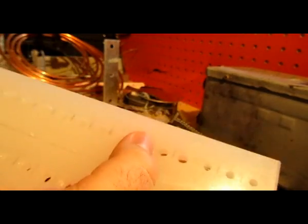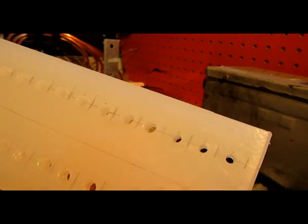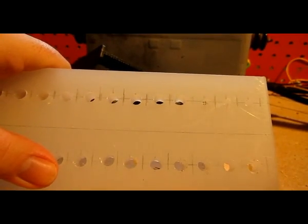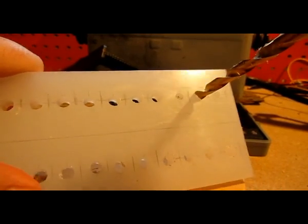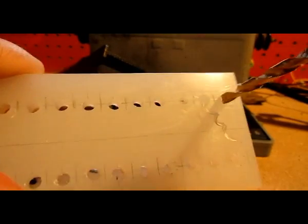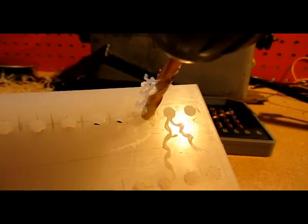We've seen these last three 5/32 inch holes — there's just over a quarter inch. I'm going to work in at one end and let's do one straight through — just like that. It just jumps right through. I've got the torque set up higher to sixteen now. And there — that is all of my quarter inch holes drilled out all the way down the entire run of this thing. You're going to have quite a bit of shavings, so have a waste basket nearby.